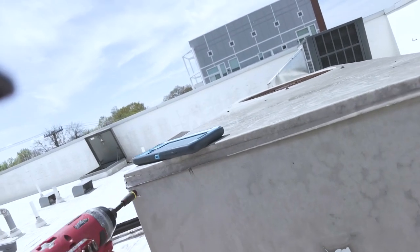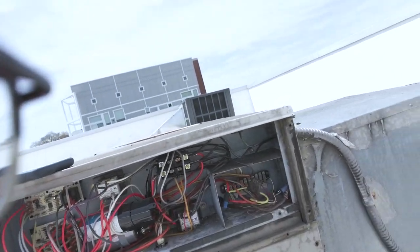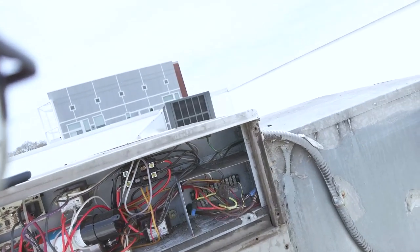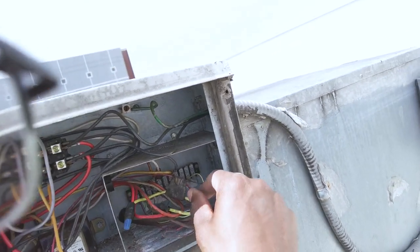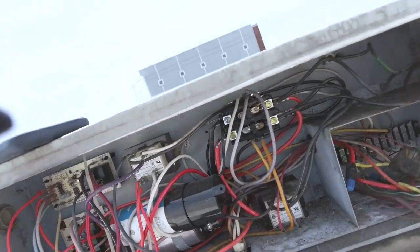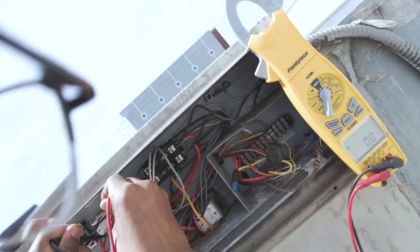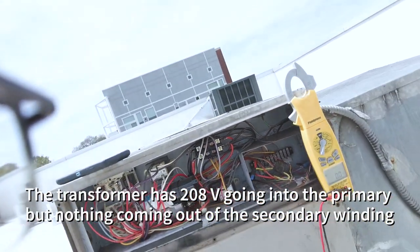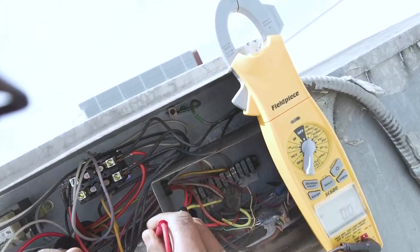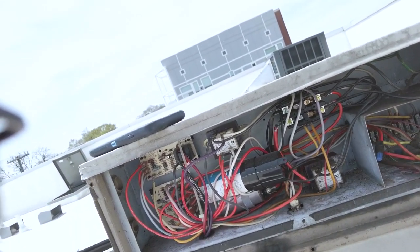I have a feeling we've got some low voltage. The fuse is still intact. I'm going to go ahead and check the output — the 24-volt center — see what we've got there. And of course, nothing. Let's see what we've got going in — we've got 208 going in. That transformer might be shoddy, but actually that transformer is still good.